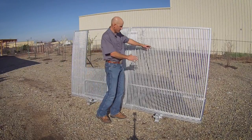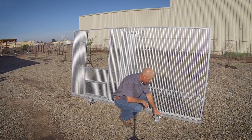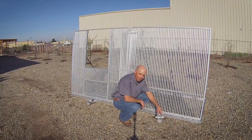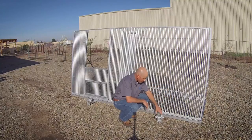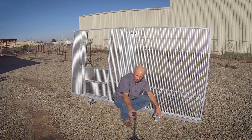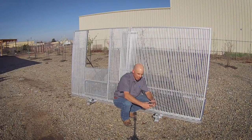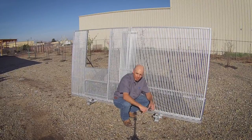As the flow hits it here, we don't want the weir to shift backwards. So here we have these ratchets, and they're on a swivel. That way, if the weir is at an angle to the river channel, this can swivel over and still be straight up the river. There will be a cable wrapped around this ratchet, and on the other end of the cable there will be an earth anchor — it's like a spade or triangle that's driven into the substrate and holds in place. Then we can turn this ratchet, tighten up that cable, tighten up that earth anchor, and this weir won't go anywhere.